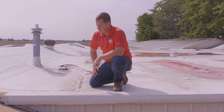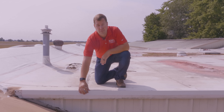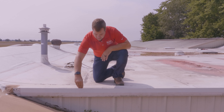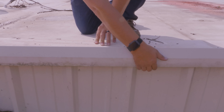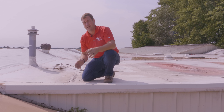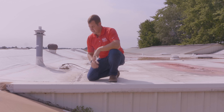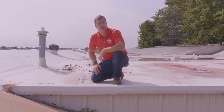One of the next things we check when looking at a roof is the outside of the roof. This is one of the critical points where it goes over the outside edge — whether it be a gutter, a straight termination bar, or like we have here with a decorative cover on top. If there's sealant on top, we want to make sure it's good so water isn't getting back behind and working at the screws. We also want to make sure it appears tight to the building. If any of this is loose, it'll need to be repaired — in a windstorm, this is going to be your first fail point for a roof to start to blow off and also have water drive in to create a leak. This all looks pretty solid here.